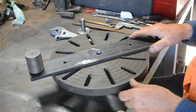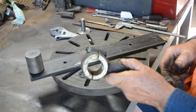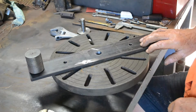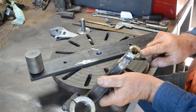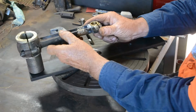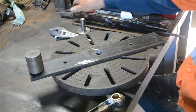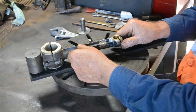Here we have a method — my method — of turning these big end bearings. I use the engine lathe. In previous videos I showed how we extended the rod and were going to turn the gudgeon pin. We put it on a frame, a fixture, and held it here with a bridge clamp across the part to hold it in place, and we bored the gudgeon pin.